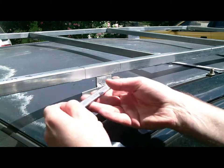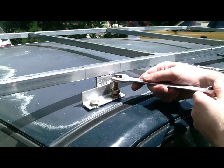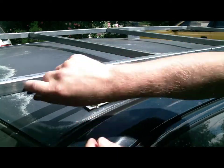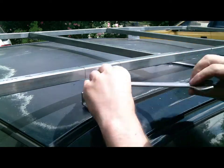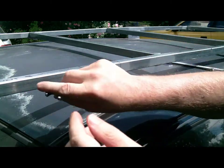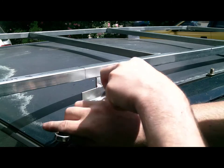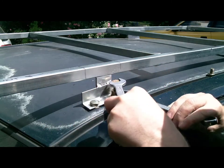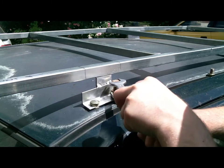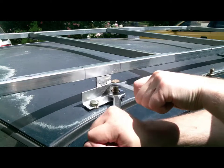So with the frame in place, that'll also stop that rivet nut from turning sideways. If you're doing a rivet nut this way, it's a good idea to have a piece of steel with a hole in it, clamped down to the surface you've got the rivet nut going into. Now to tighten up the rivet nut — you have to sort of tighten that bottom nut and keep the top bolt still. The bottom nut is essentially pulling that bolt out, pulling that rivet nut tighter.